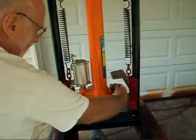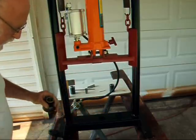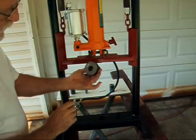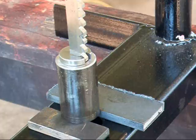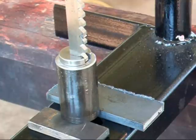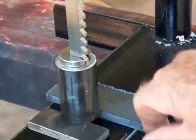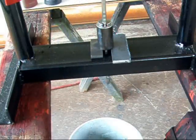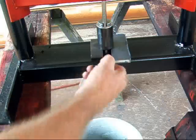It is all finished broaching. What you see is you have got the keyway broached into the blank for the die on the bead roller. There is the other side of it. This will give you a little better idea of how the broach teeth come in there and trim it up. Each tooth is going in there and cutting off a small amount of metal each time it goes down. As the bottom of the broach comes out, little pieces of metal fall out.